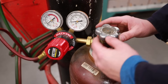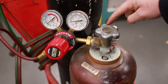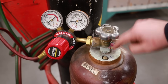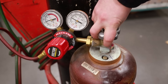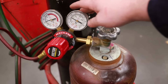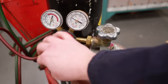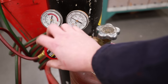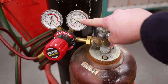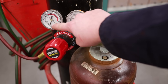First we're going to do the acetylene first. We're going to open up the main valve here half a turn — I've drawn a little line here to help remember. Half a turn. The last person who used this did not purge the valves, so let me just purge that valve for a second and release the pressure on my regulator. This gauge shows how much fuel is left in the cylinder, and this one shows how much pressure will be coming through.